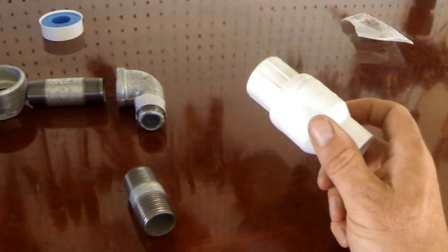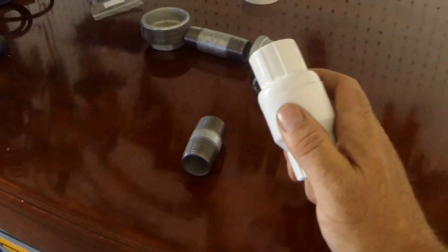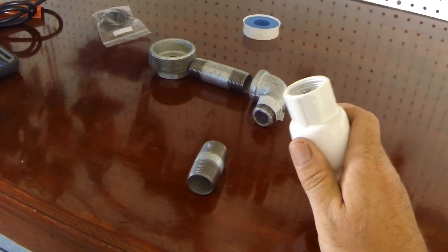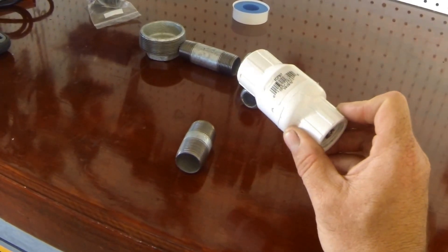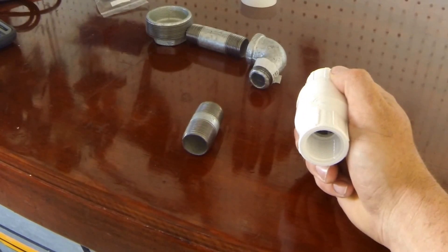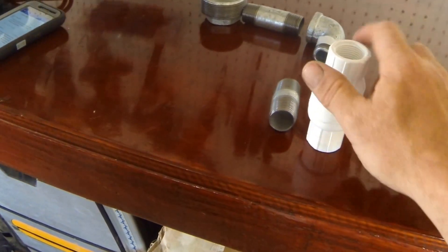The reason why I put the check valve in — guys online on the truck mount forum were saying the water acts as a barrier at the bottom of the tank and you don't have to worry about vacuum. But I've opened my dump tank running full throttle hoping it would just leak out, and it's still sucking water. I have a Roots 47 blower in that thing and it's pretty powerful. So I really think a one-way check valve is necessary — it's definitely worth having. Plus it protects your blower. There was one time I set my dump hose in some gravel and forgot the valve was open on the dump tank, and I sucked up some gravel. Really worried about getting rocks in my blower, so still a good idea to have.